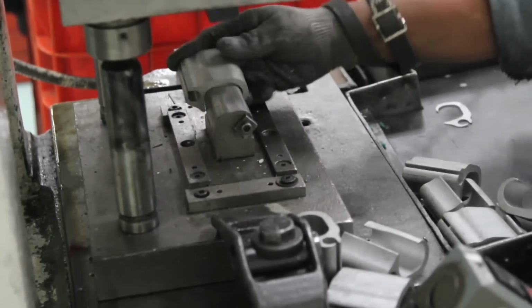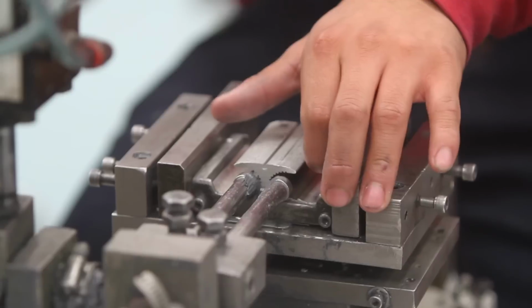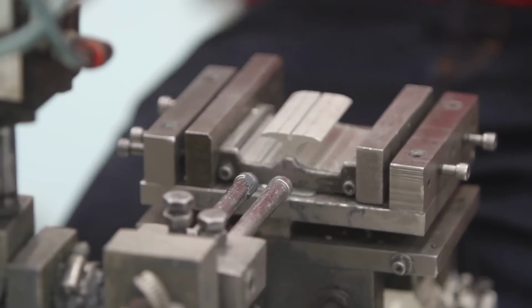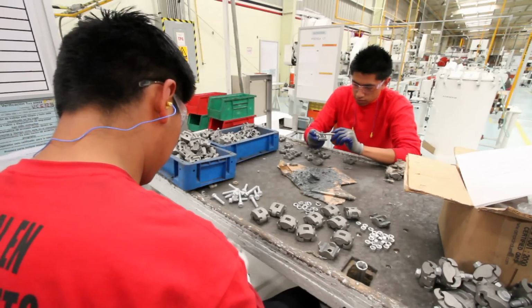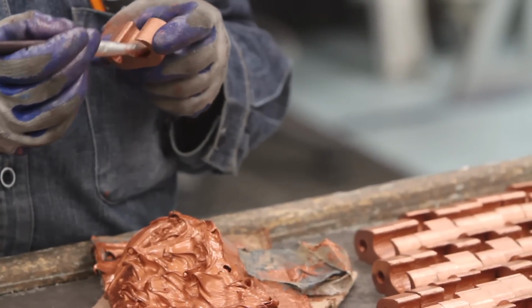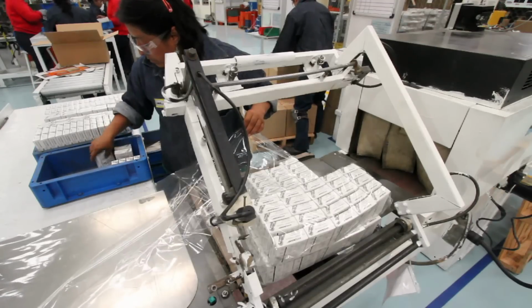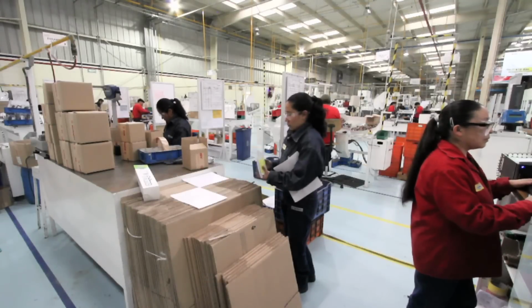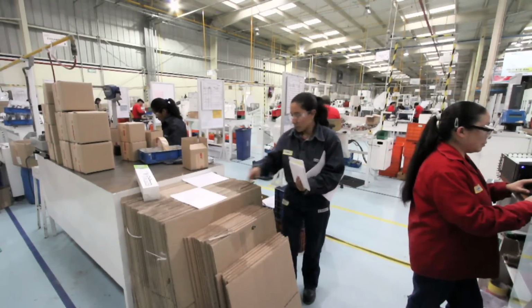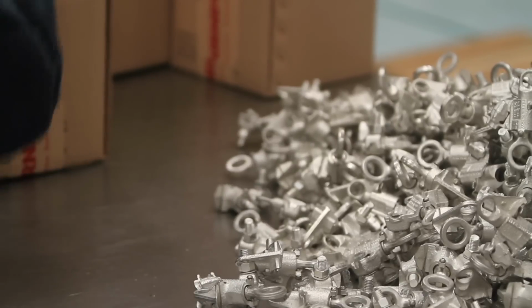The material, after being cut, goes to the washing room where it is processed by removing excess cutting edges and applying an antioxidant. The next step is stamping, turning to the application of Penetrox, and after bagging and packing, it finally goes through the releasing process, which takes place under the most strict quality standards established throughout the manufacturing cycle for our products.